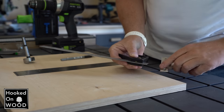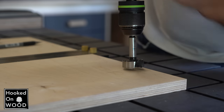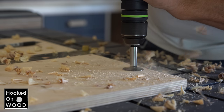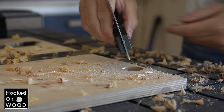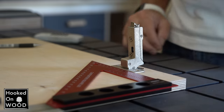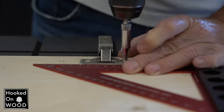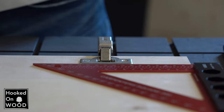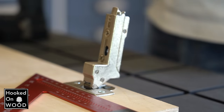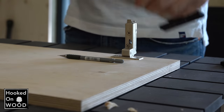Placing a hinge is not that hard to do, but doing it consistently — especially when a door needs more than 3 or 4 hinges — can be a bit more tricky. When you have a well-equipped workshop, I do not think you necessarily need a hinge jig. But when I tried it without, I realized I already used many tools: an accurate T-ruler, careful placement of the forstner bit, a good stable drilling machine, something to check hole depth, and a self-centering drill bit to align the hinge. Not that hard with the right tools, but it still takes a lot of steps, and with most of those steps there are risks of errors.